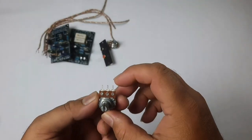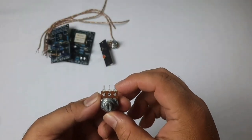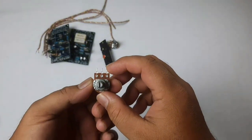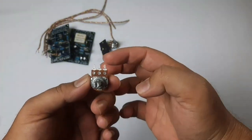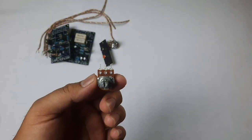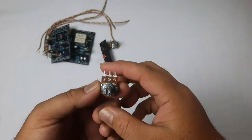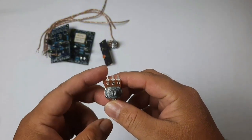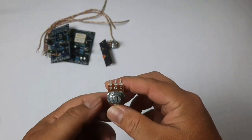The first foot on the right side will connect to ground, or CT, from the power supply. The second foot is the output and connects to the driver power amplifier. The third foot is the input coming from the RCA socket.